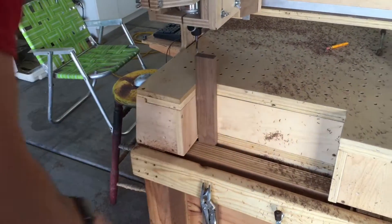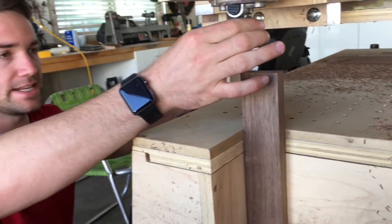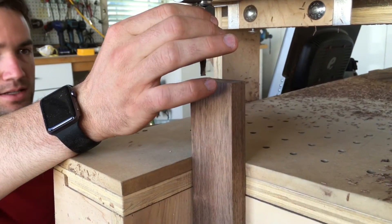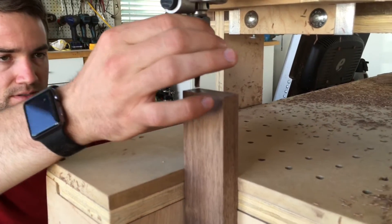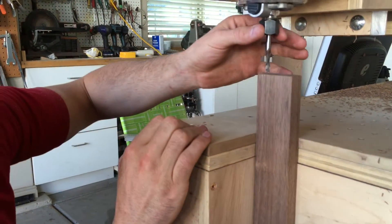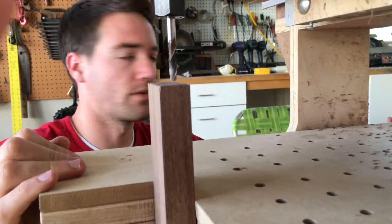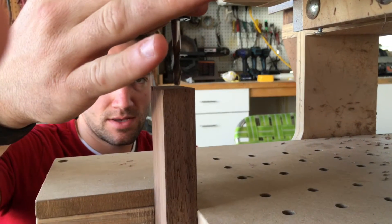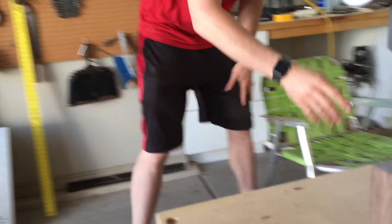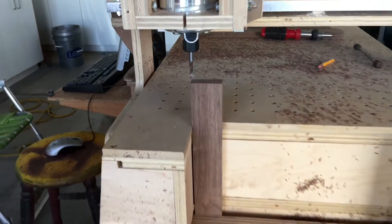Then I'll take this and clamp it up against the edge — it's solid. And because every piece might be a tiny bit different, I take it over to where I need to have it zeroed and bring it down. I have my g-code written to do on this corner over here. On Mach 3, I just zero this out and turn on the router.